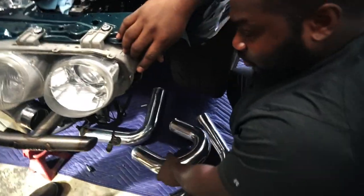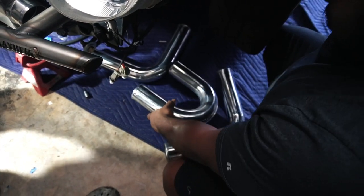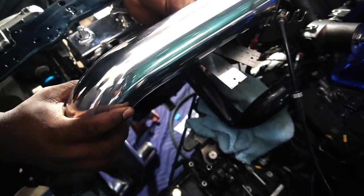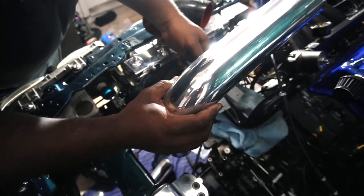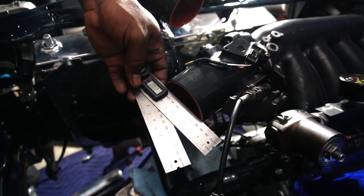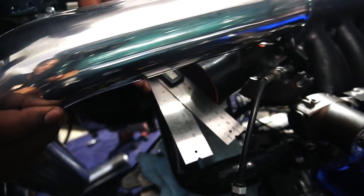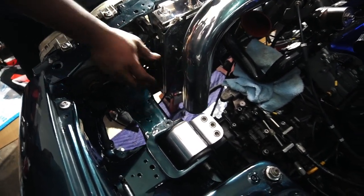Pie is always a lot of work. If I could just bypass, cool. Unless you don't have to pie, you could cut a section out of whatever angle it is, out of a piece of it and have it turn. You do what you got to do — whatever is easier for you, dog. What Keem was saying is you have to do two 10-degree pie cuts. Put this to the pipe to rotate it 20 degrees and it comes out straight. That's swag.